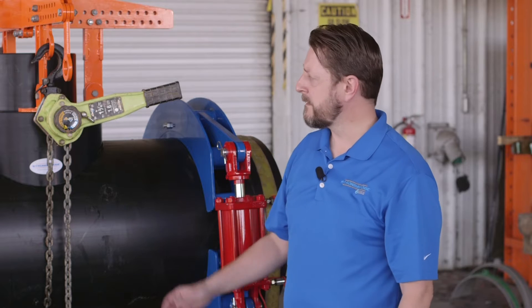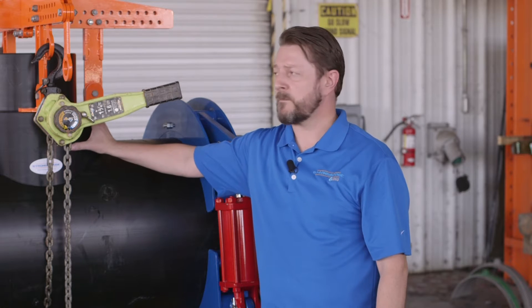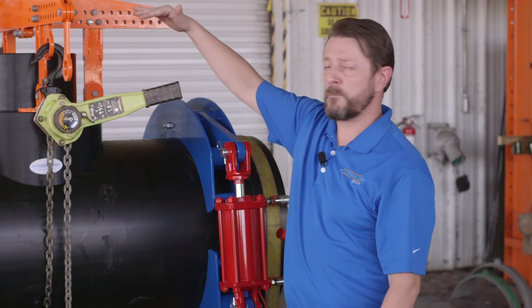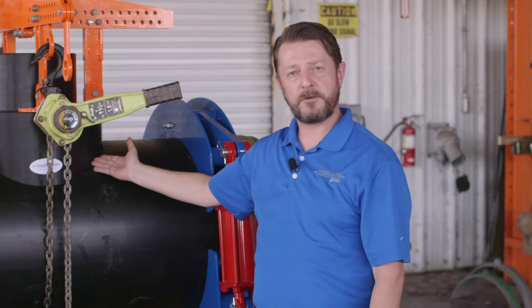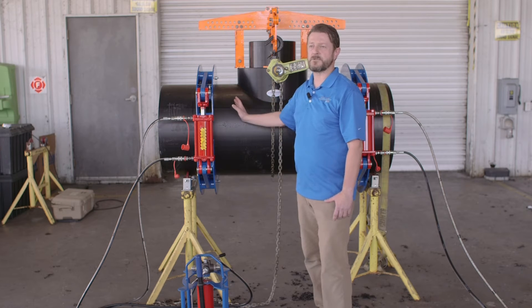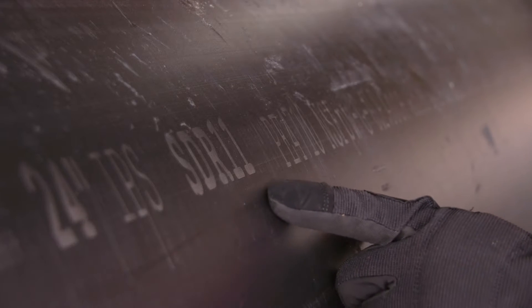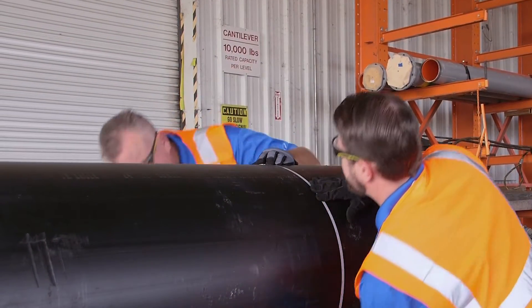Let's review the tooling for this large diameter Electrofusion saddle installation. We have our pipe system and our Electrofusion coupler, which is a 12-inch outlet, held in place by our special spider tool, which provides enough interfacial pressure to ensure a proper fusion between the saddle and the pipe surface. We're also using hydraulic re-rounding clamps, which provide rounding of the pipe to ensure there are no gaps between the saddle base and the pipe surface. These work via a series of hydraulic pistons and a pump kit. The print line on HDPE pipe will verify the pipe size and OD convention. To ensure the pipe is within spec and compatible with your chosen fitting, measure the diameter using PI tape.